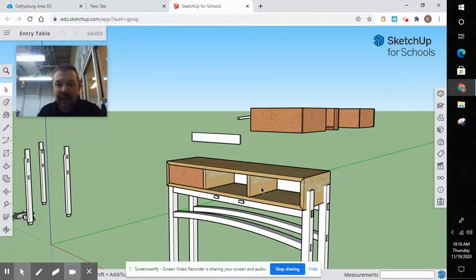First thing, what you're going to need are these dividers. You can see them right here. If I select that part and I move that, there's my divider. You need to do some simple math here. I want 3 bays for 3 drawers. So bay 1, bay 2, bay 3. This stock here is going to be 3/4 inches thick.